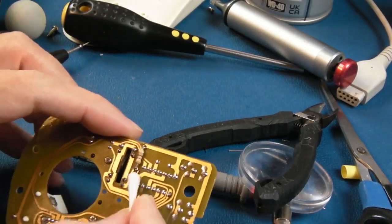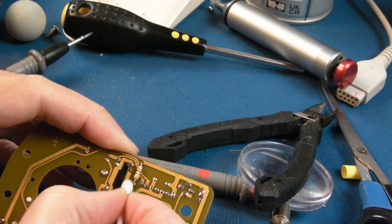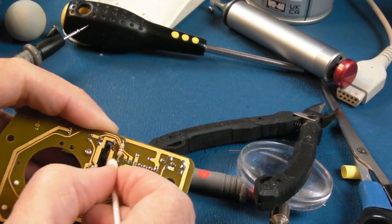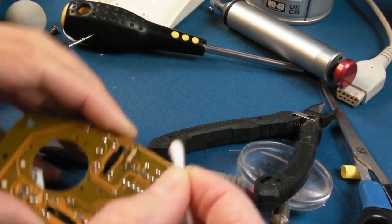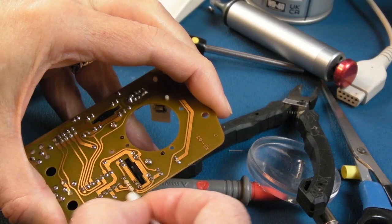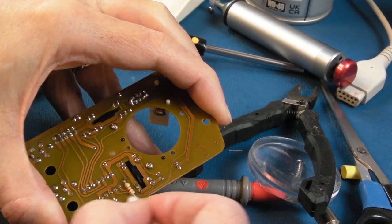At least we know the one I'm writing on was 940 nanometers, I think it was. So that's probably a good ballpark. Most of them are probably like that. So just get yourself some 940 nanometer infrared LEDs, because they're useful to fix these mice.